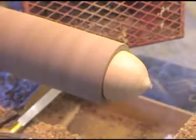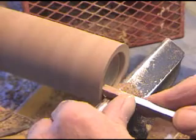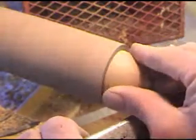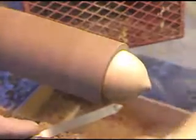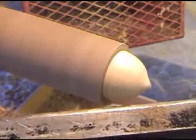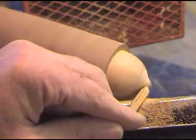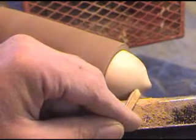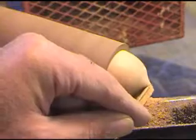Once we get it to kind of set, we've almost got it in there. Go ahead and get it tightened in there. Now we can true up. Light cuts because we're just friction fit in there, and we're getting a lot of torque out here on the end.